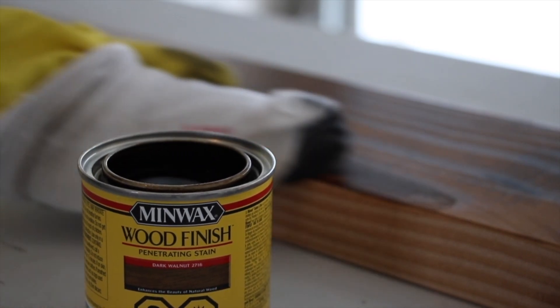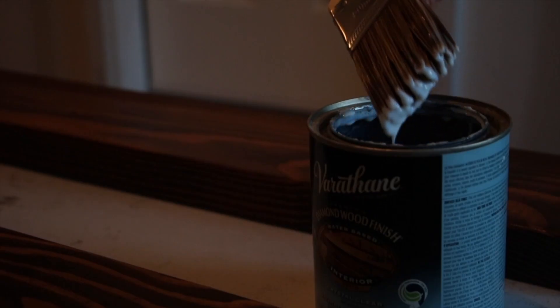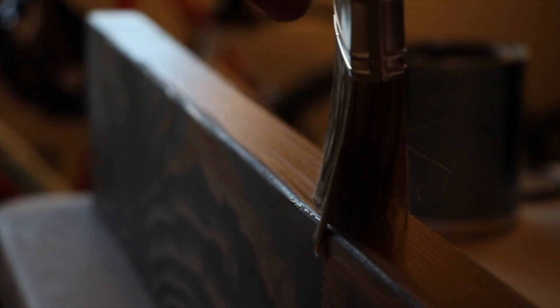One thing I forgot to mention is that it's really good to sand in between coats of stain. I was using about 320-grit sandpaper, which helps smooth it out, gets rid of any blotches of stain that may have grouped up, and gives you a nice smooth finish towards the end. Once I've got another layer of stain on for each different stain for the boards, I'm going to be moving on to the poly, which is the final thing to do, and then I'll be able to start putting this together.